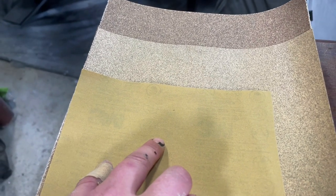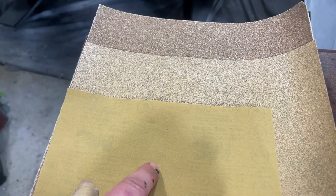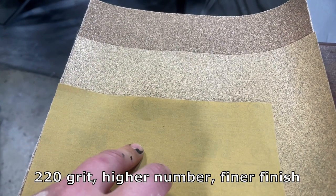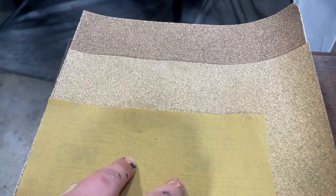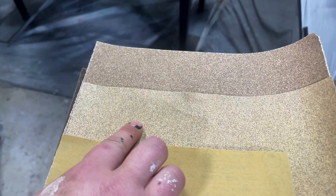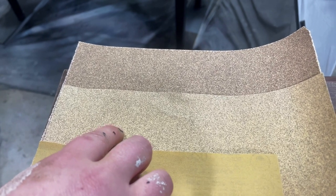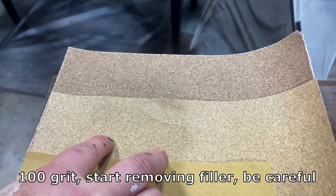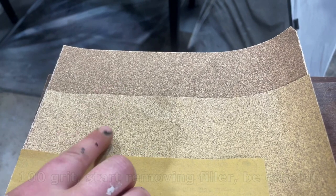It's very important to understand the basics of sandpaper for scuff sanding and for removing the extra fill in the dings. I'm going to be using a 220, which is a finer sandpaper, because this is an older finish and I don't want to damage it. You might want to use something a little tougher, like a 100, if you overfilled and didn't scrape enough off and need to remove it more quickly.